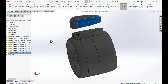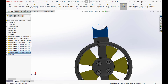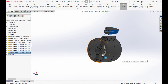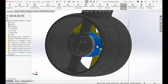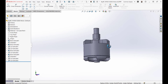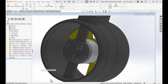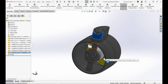It didn't have this spacer — I designed this spacer to fit the PVC pipes I use for framing everything. This is just a separate piece. When I work on these designs I usually create the off-the-shelf component first — here is the motor. I just model that ahead of time so when I create the assemblies I can get proper spacing and fit for all the other parts, because this is a part whose dimensions I don't control.